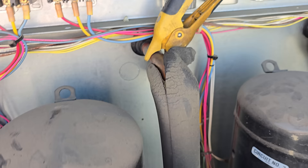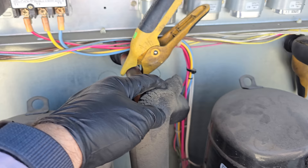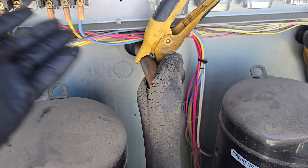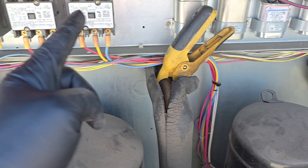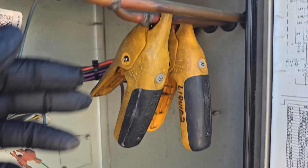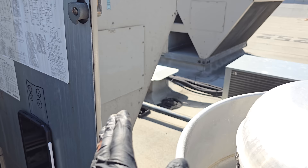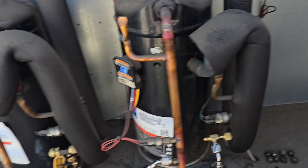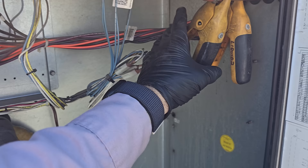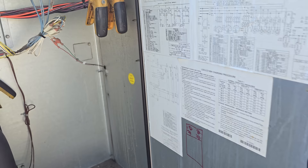Low pressure placement is pretty obvious on the low side. For suction line — it's not bad right here, but make sure you have insulation. We're more or less checking compressor superheat, which is fine. For liquid line temperature, you want it coming out of the condenser — ideally directly out of the filter dryer, or you could get closer to the expansion valve. It goes: discharge line into the condenser, out the condenser on the liquid line, then to the expansion valve. Some might argue to put it closer to the expansion valve, but right here is fine.